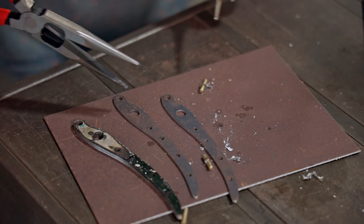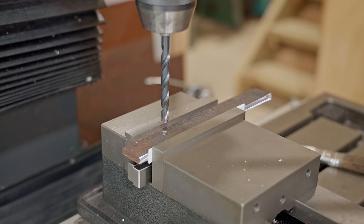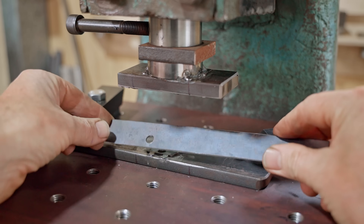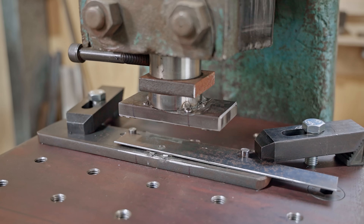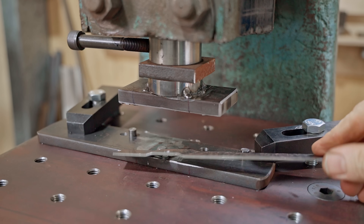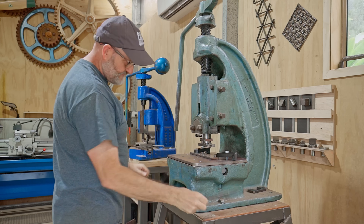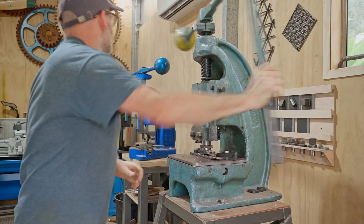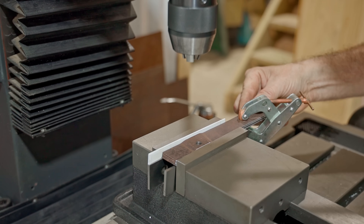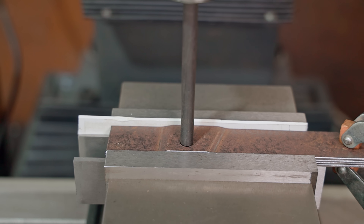That's the flat sides of the handles done. Now I'll start the opposite pieces that need a bridge section bent into them. The first thing I'll do is drill a center hole, which I can then use to reference off, and I'll do that by placing it on a locating pin on a jig that I made for the fly press. That really worked awesome, and because it's repeatable they'll all come out exactly the same. Now I need to drill the other two holes and I'll drill those through all four pieces at once, moving the table the correct amount along the X-axis on either side.